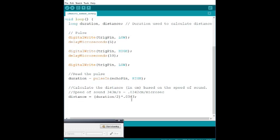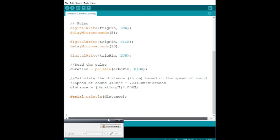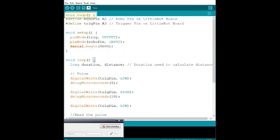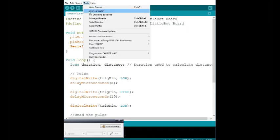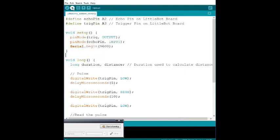To see that distance value, we print it to the serial monitor: `Serial.print(distance)` — that should output in centimeters. After double-checking all loops are closed, I auto-format the code and upload it. Go to Tools, make sure you have the correct COM port selected, the processor is ATmega328P — I'm using an older chip so I select the old bootloader Arduino Nano — and make sure you're on the Arduino Nano board.